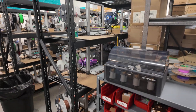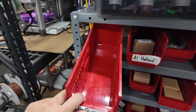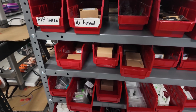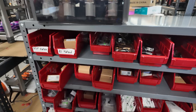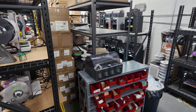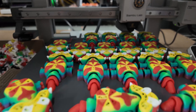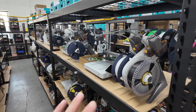If I restarted everything, I'd get a fleet of Bambu Lab A1 Combo printers so I can source spare parts for just one model. Down here is our spare parts area, separated by P-series and A1 parts — we're actually out of P-series hotends. We have to keep spare parts for both model types on hand because we have two different models. I would definitely get the A1 Combo over the P1P and P1S if you're primarily printing in PLA, want multi-color, and don't need an enclosure.